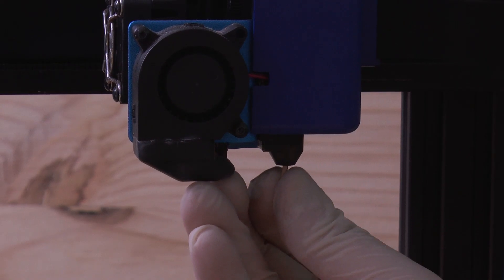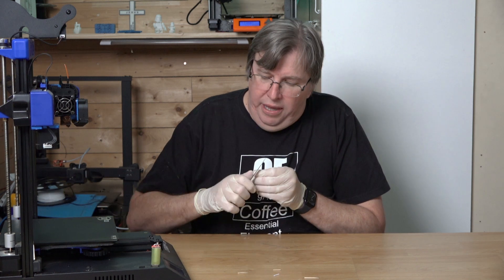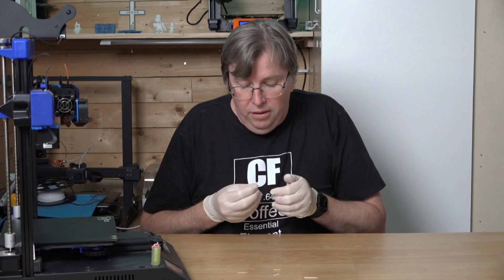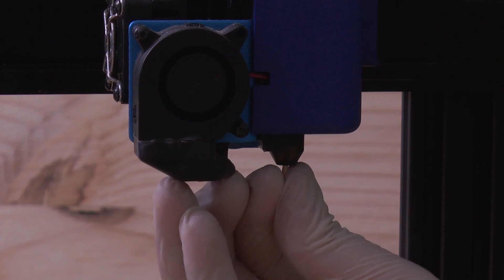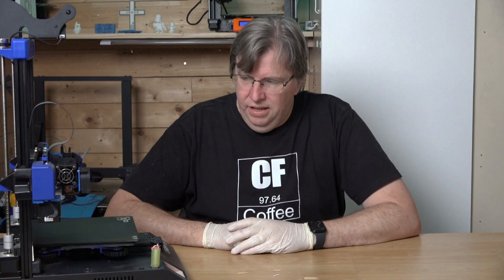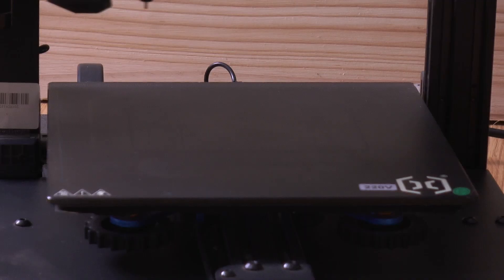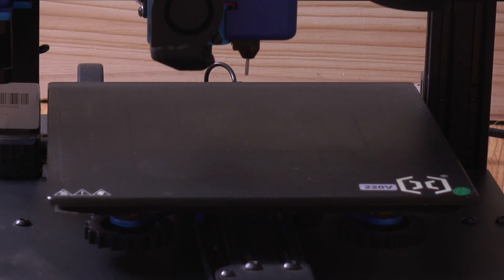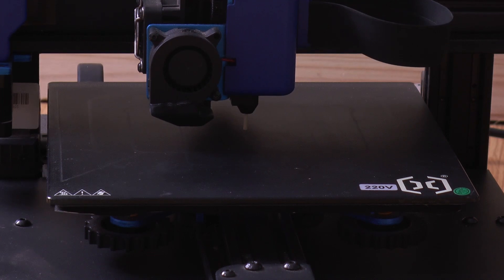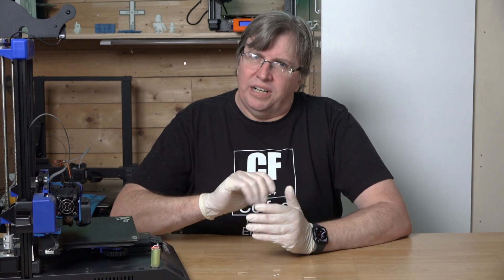So now I'm going to try to push this in — we want a nice snug fit. I'm going to take a tiny little bit more off, clean off the bottom edge to make it more round. There we go — now if we put this in, it fits nice and snugly. Now that we've got the pin in, we need to home it. Let's test it and make sure the homing works. I'm going to press the home button — it goes and homes the X, the Y, and here we go, the Z. The pin pops out nicely, goes down and probes the bed. Perfect, very happy with that. You can also use side cutters if you don't want to use a knife — that could work slightly better, but I use my knife because I can clean it off and also clean off the edges.